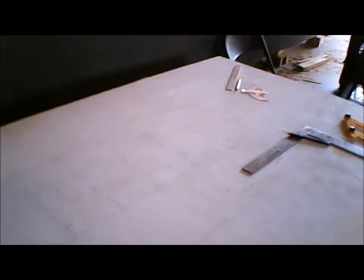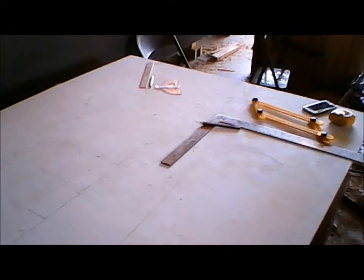I've just laid out all my dimensions on my table here — my primed piece of half-inch plywood. I have all my station lines measured from the midship's point to the chine, which is right there. All my dimensions are written out in six-inch scale, so pretty easy. All the way back, I've gotten all my angles and hopefully my bevels are all written down as well.